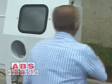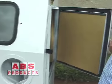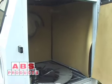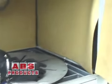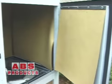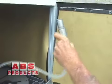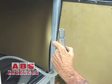We've got a double-lined door. This one's lined with Buna rubber, so if you're using shot or anything it does not bounce off and doesn't wear through your cabinet. It makes it much quieter and you don't tear up your glass on the windows. We use a soft whip abrasive hose — it's real soft so you don't get tired at the end of the day.